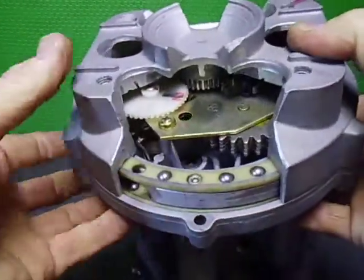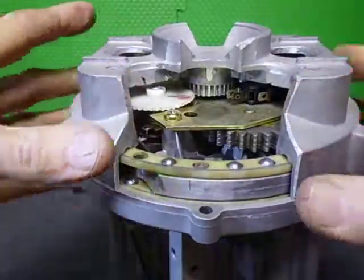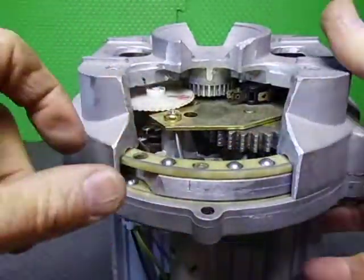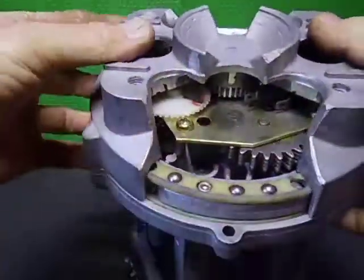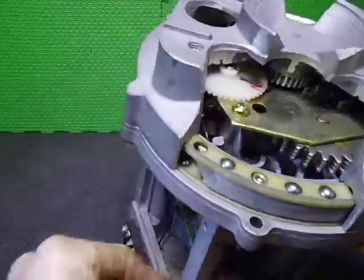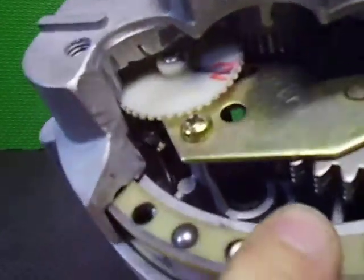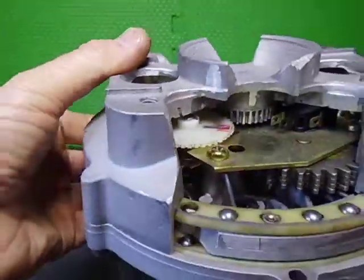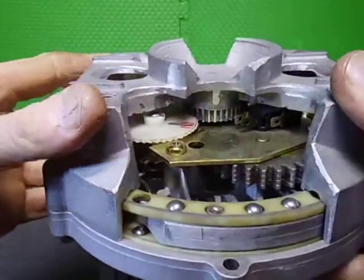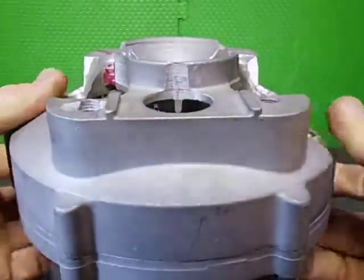To do the service on the top half, you've actually got to pull the top casing off, and then remove — not two but four — of these big bolts going into the upright struts here. The big allen key bolts are down in there. You've got to remove all those just to physically get to the bottom bearing tracks. It's a bit of a job to get them done.